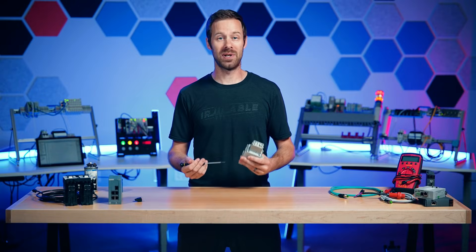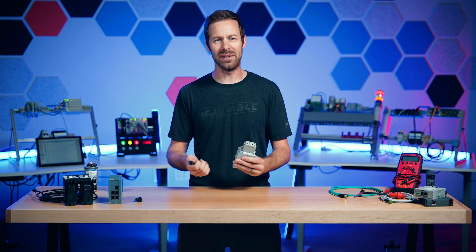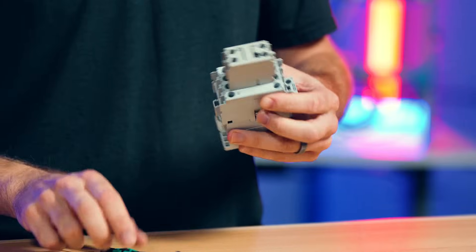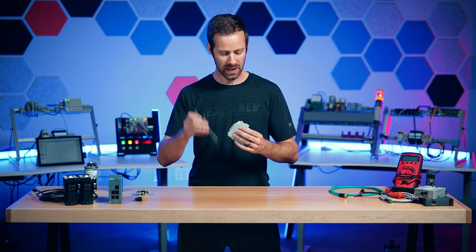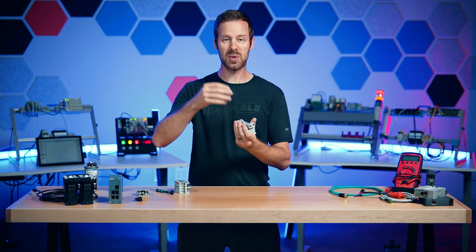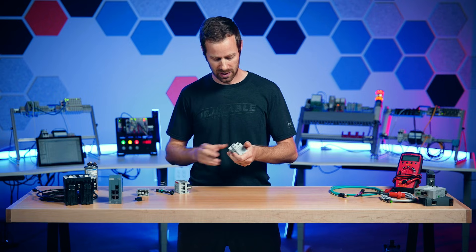Contactors are really cool for starting motors in a simple way, but they're really nothing more than large relays. But what actually makes them work? What's going on inside a contactor? Well, best answer is let's take a look inside. On this contactor, we're going to first remove the auxiliary contact block at the top, and using little clips on the side, we can remove the top. Inside we see the spring that returns it back to the normal position when energy is removed.